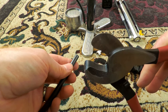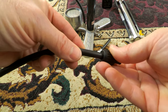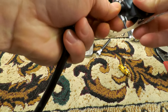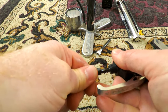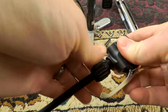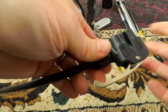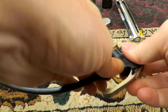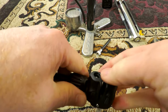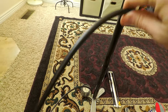There we go — cut that end off. It's nice to have something that actually cuts hoses. Now put that fitting on — it does fit in there. Take a little WD-40, all that does is lube it up — silicone works too — and just slide it on. That slid on easily. Some reviews said they fought with it but maybe they didn't lube it. I worked in the propane industry running my father-in-law's propane business, so we used a lot of WD-40 and silicone to put hoses together. That goes on just like that and tightens it onto the valve. That actually worked — I was surprised.